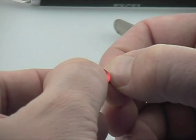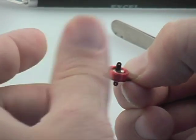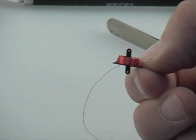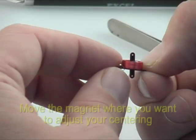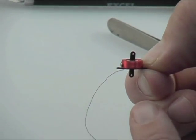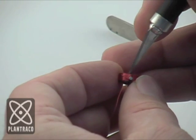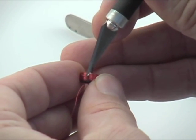The magnet is on the outside of the coil and it adheres to the magnets inside. By sliding the small magnet around on the outside we can get perfect centering. We just move it around until the control output horn of the mini act is nice and centered.